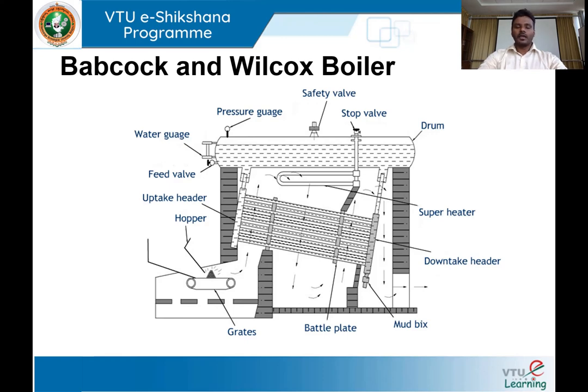Once sufficient water is charged into the boiler drum, combustion of fuel releases hot gases. These hot gases undergo three passes. The hot gases released from combustion move upward — the baffle plate compels or guides them upward over the water tubes, causing heat transfer from the hot gases to the water. After moving upward, the hot gases move in a downward direction, guided again by the baffle plate, heating the water inside the water tubes during this second pass.